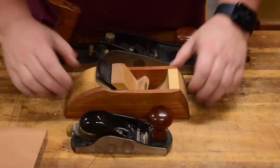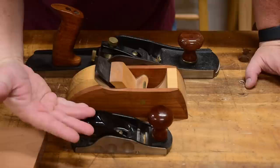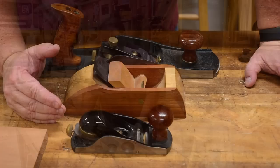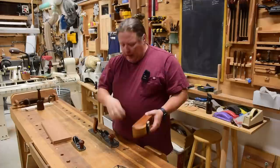People sometimes get confused because I've got a wood plane intermixed, and in our craft a lot of times people gravitate towards all metal or all wood because they're slightly different. The reason my main smoother for big projects is wood is because of how I've got mine set up — I just think it works better as a smoother. But how could that be, because we all know wooden hand planes require more maintenance, and smoothing planes are the absolute most finicky planes we use.